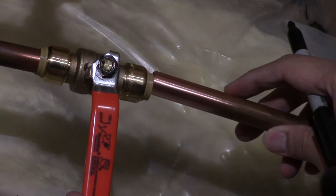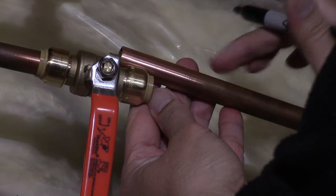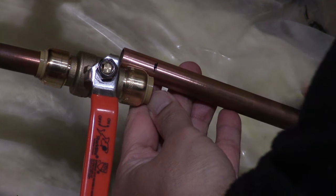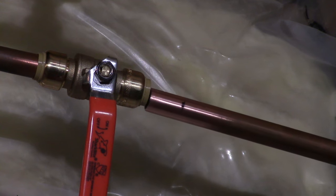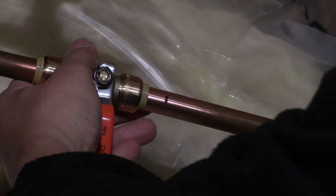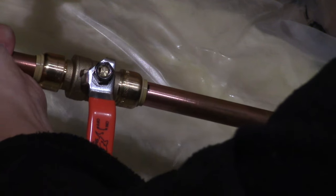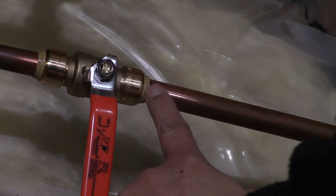On this side I'm going to mark out the depth so I'll have an idea how far the pipe will go inside the valve. Although I didn't do this on the other side, this is always a good idea — this way you know for sure how far the pipe has bottomed out inside the SharkBite. Now I insert the pipe into the SharkBite, and notice the marker is now flushed to the edge, therefore the pipe has correctly bottomed out.